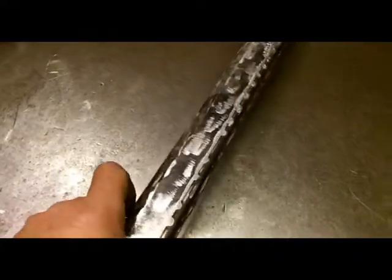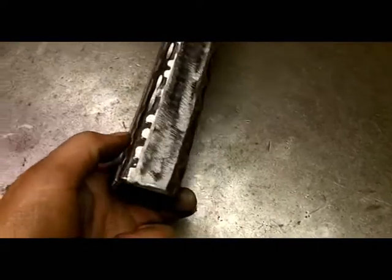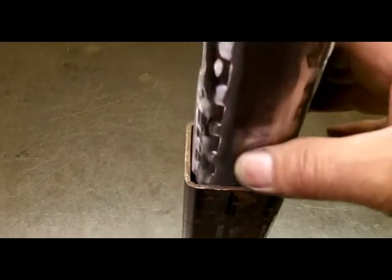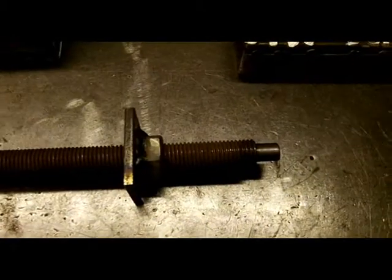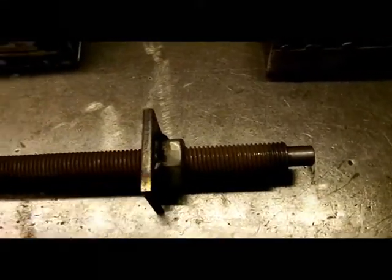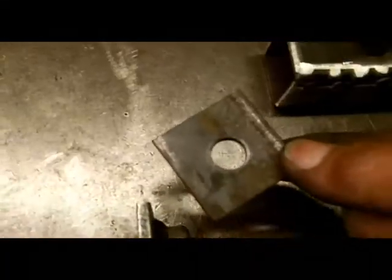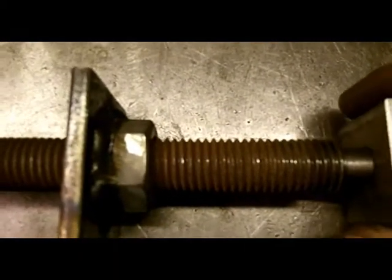Here you see it all ground down. These are only guide bars — you don't need to fully weld them, just wee light tacks — because they're just stopping it moving sideways in the other box section. When the threaded rod's attached, this will raise and lower to put tension between the two wheels. This is the threaded bar — I'll cut it to size. This section of nut is welded on and will go into the box section, welded in at the bottom, and into the box that slides up and down, I'll weld this on to the end there. That will sit over there.